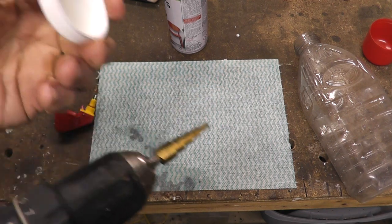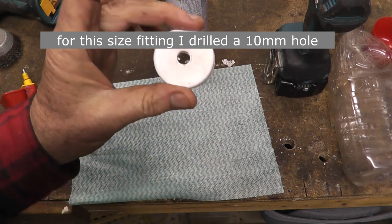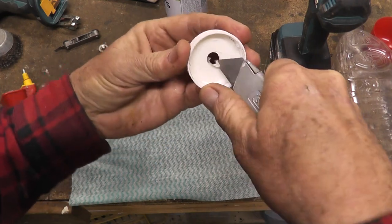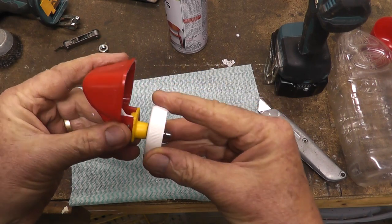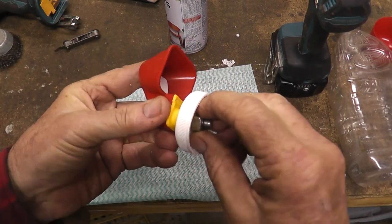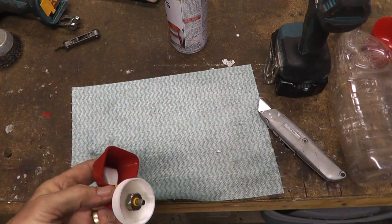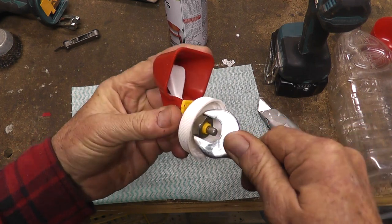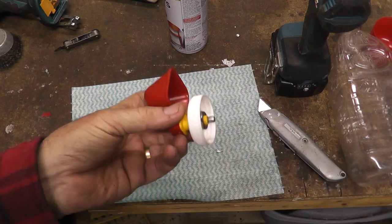Don't be tempted to hold the bottle in your hand when drilling. Once you drill the hole through, trim off any plastic on the inside but try not to make too much of a chamfer - you don't want the o-ring to miss that chamfer. The fitting comes through from this side, with the o-ring sealing on that face. Put your nut in and make sure it starts nice and straight. Just get your spanner and nip it up - it shouldn't need to be too tight as you're only compressing that o-ring.